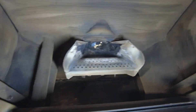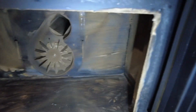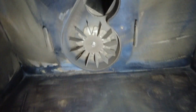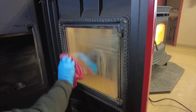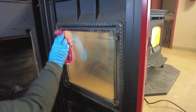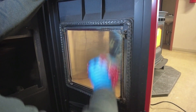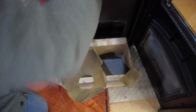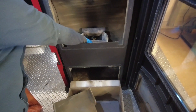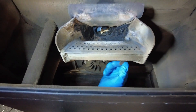Here's a look at the firebox after a good cleaning — all the panels are out and everything is removed. Next up is the glass. We use a glass cleaner available at your local hearth store; we stick to what the manufacturer recommends, so if it's designed for pellet stoves or propane fireplaces it works really well — wipe it on, wipe it off. Let it sit for a little bit to remove residue, though pellet stove residue isn't usually too bad compared to wood stoves. Now she's assembling things back together — the deflector and the plate for the igniter — and tightening those screws back up. If that's not in the correct position it will leak air and cause delayed ignition.